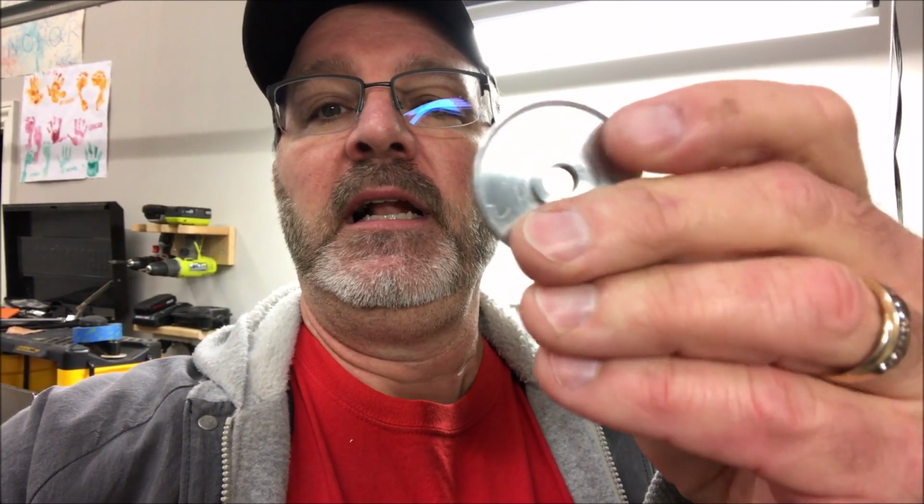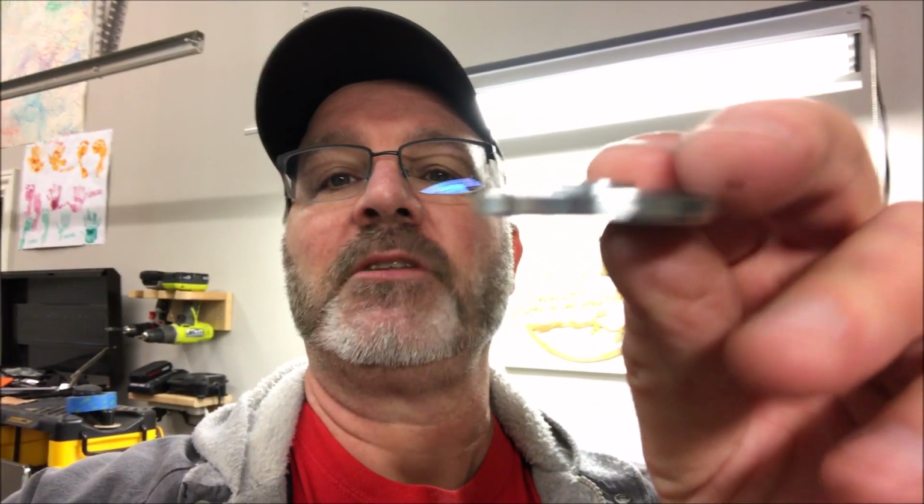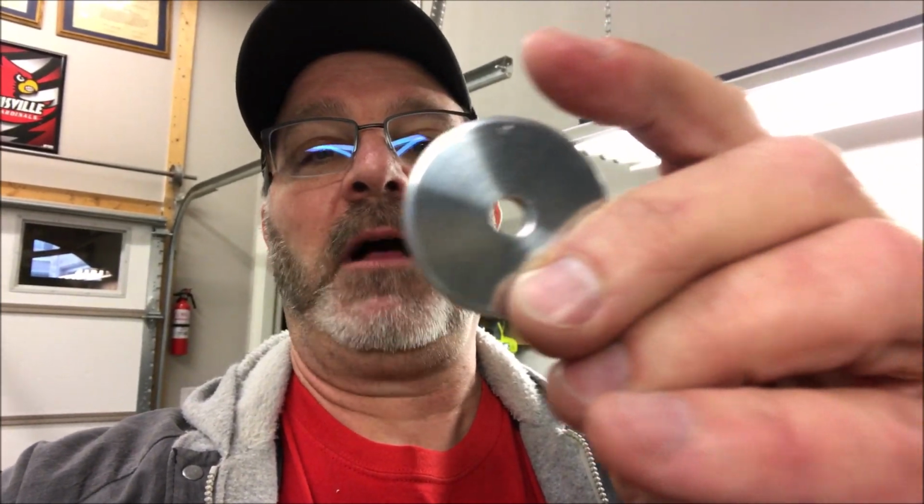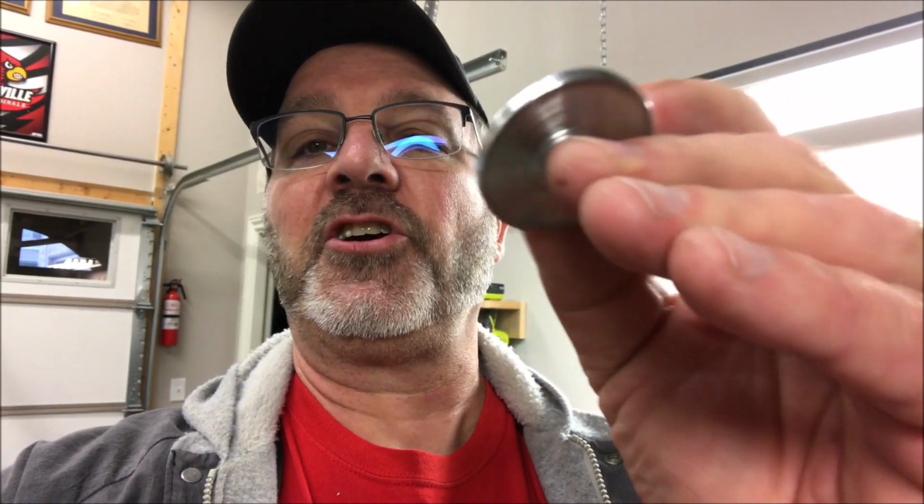This piece of aluminum is quite a bit larger. I had to turn it down to this diameter. And you'll notice the spindle on the bottom, how it sticks up past the bottom of the piece. What I did is I had turned a lip there so this could sit flat all the way around 360 degrees on the turntable. But what happened is I didn't estimate, not thinking ahead, that's why you go to school on the first one, how much of this I had to turn down, about that much, which basically turned my lip away. You can still see kind of the remnants of the lip, but it actually angled up and was the same height as the center spindle.